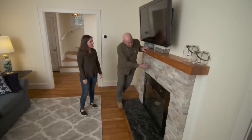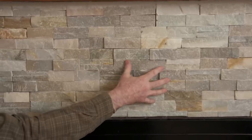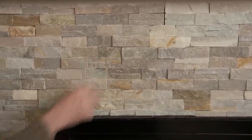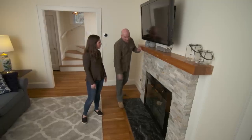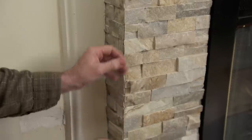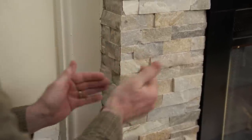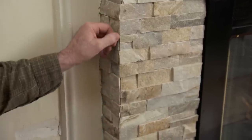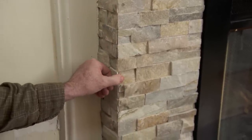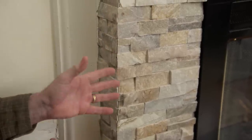Just starting in the face — you can see that these are not individual pieces. They're actually blocks that are weaved in together. And when I can see that weave, it's probably not a good job. That's the first thing. But another thing — if you look at this corner, they actually sell corner pieces which would give you the illusion that you have a full stone going back into the wall. What they've done is they tried to make it a 45, but you can see they stick out like tabs. And again, they give you that inconsistent, unclean look.